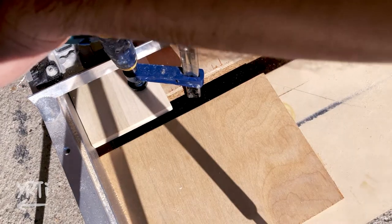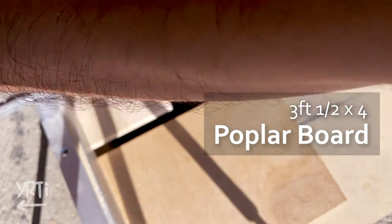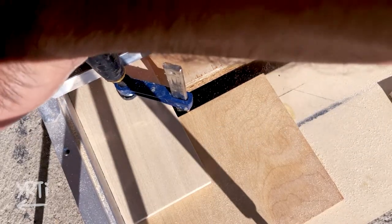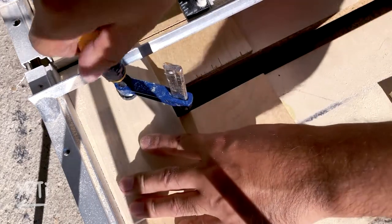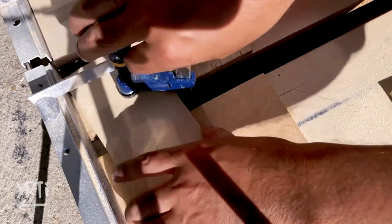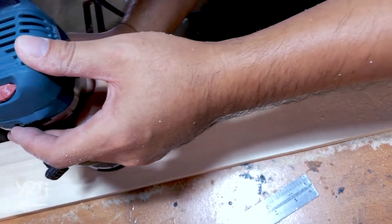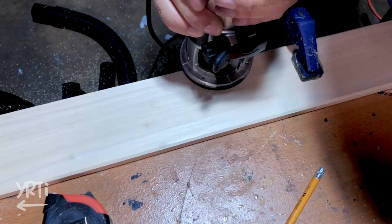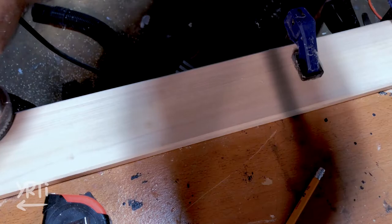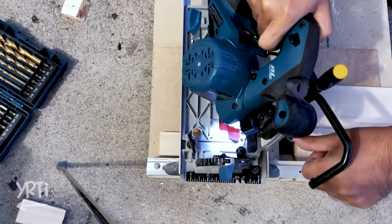Let's get onto the woodworking. I used 2 of 3-feet, half-inch by 4-inch Poplar boards, which are just $6.50 each, and cut them to the length I needed. For a DIY beginner like me, Poplar is good because of its price and easiness of handling. Then I made grooves for joints and trimmed the edges with a router. And then I did bevel cuts for miter joints.